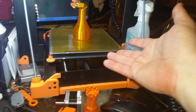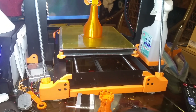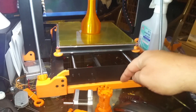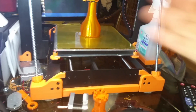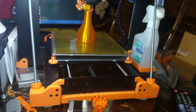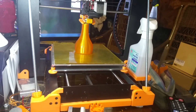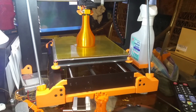I haven't leveled it in two weeks. There's no reason to level it — it works perfectly. I've even flipped this printer upside down to install something on the bottom and almost dropped it, and I still did not have to re-level my bed. Once you replace that Y plate and add the Z-brace, this just keeps your printer from vibrating around. I hope this was helpful to you. Good luck with your printer. Thank you.